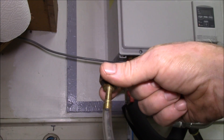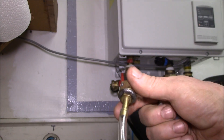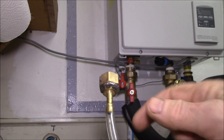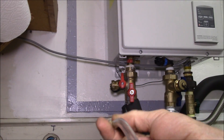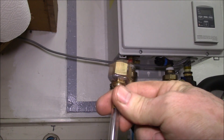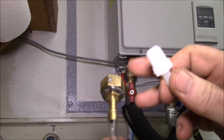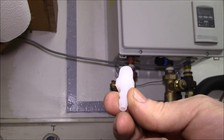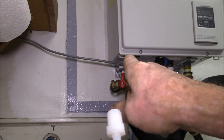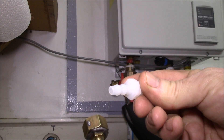The slight concern is that the condensate is slightly acidic — about equivalent to lemon juice — so there might be some problem with the brass being attacked over time. I've been using this for two and a half months and it still looks pretty much as I put it up. I'll keep an eye on it and check it once a year. I do have a plastic hose barb fitting here, and if the brass proves to be a problem, I'll switch to plastic — though I'll need a couple of adapters to get up to the pipe thread that fits the bottom of the heater.